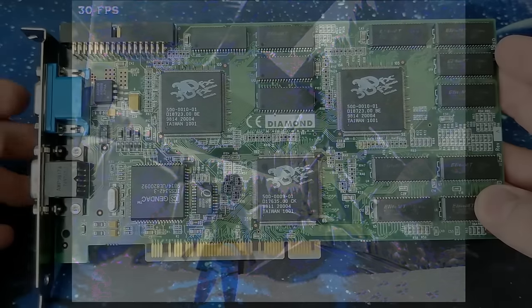Where is the problem? Could it be the digital analog converter, which is also on the card and connected to the 5-volt rail that damaged the memory chips? Or could it be any other of those chips that are on the board? So, if you have any experience with faulty Voodoo cards, let me know.